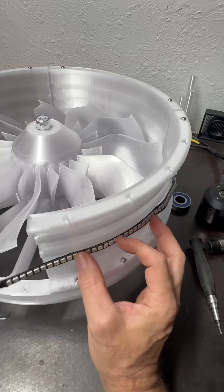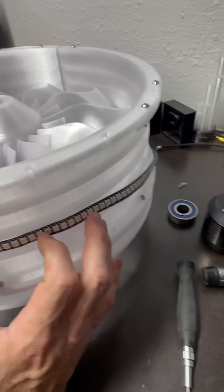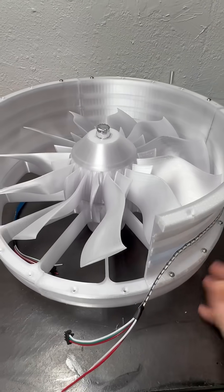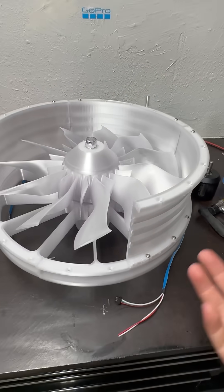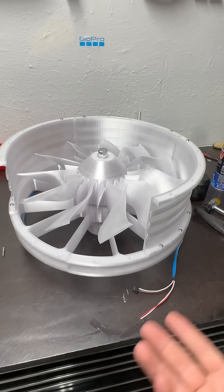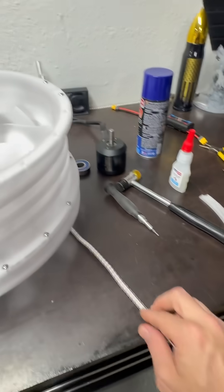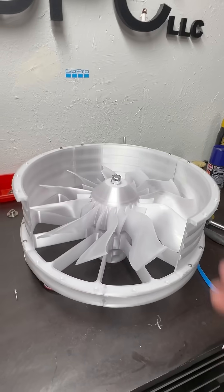Then we're going to put the lights on. I thought about doing four strands, but because these LEDs are close enough and the ductwork will actually diffuse that light really well all the way through, I think we're going to be good with one strand. Otherwise I'd have to power over 1500 lights. So 144 close addressable RGB, Arduino-controlled will be plenty.